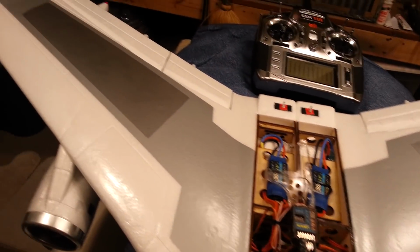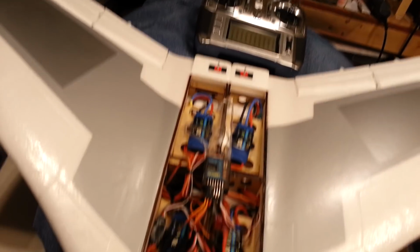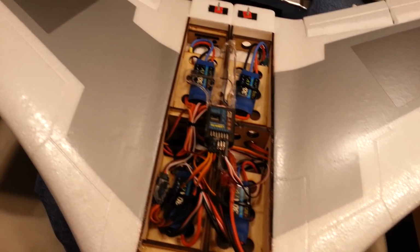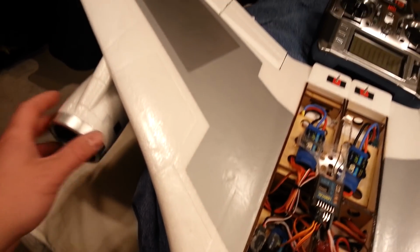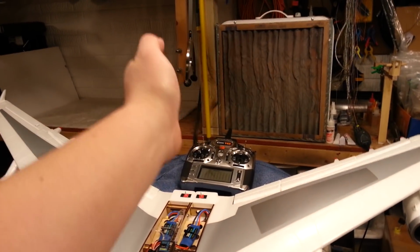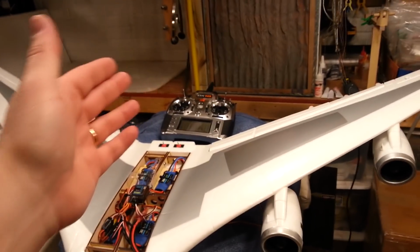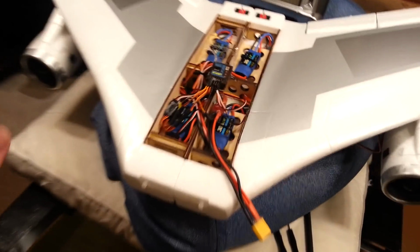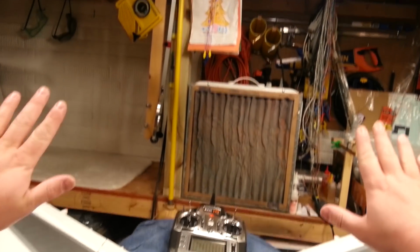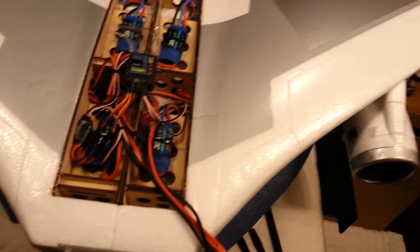Okay, so that sucks. I don't want to give up my differential thrust because it's more effective than the actual rudder is. But at the same time, the differential thrust also, because of the tendency of the yaw, the rudder axis, to roll the plane rather than just yaw it flat, I have to depend on that for my controls. So if I give up this channel to give me this one really cool feature, then that means I'm actually going to be losing my differential thrust.